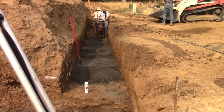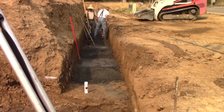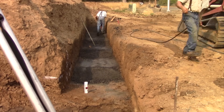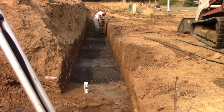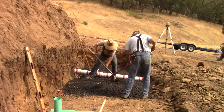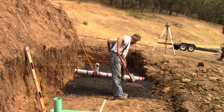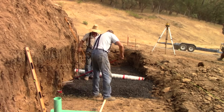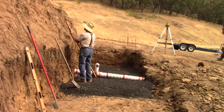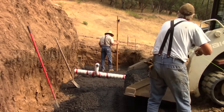After the grade was established, after all the crumbs were thrown out, after the gravel was thrown in to bring it up to grade and the jumping jack was run over the moistened subgrade three or four times, Brian moved his gear out. The next week Carl Broda came out to do another density test — another compaction test on the bottom of the footings. Now that we've removed all of the junk and we're down to what needs to be really strong, he drove his penetrometer down into the bottom of these footings, and it was harder than the proverbial stepmother's heart. We achieved bearing capacities of 3,000, 4,000, 5,000 pounds per square foot — far in excess of what was needed to support the calculations that Scott Harvey was making about footing sizes, rebar layout, and all those technical details that make the difference between success or failure.